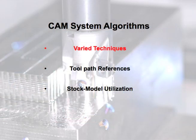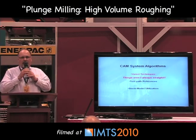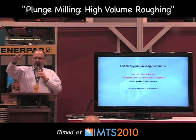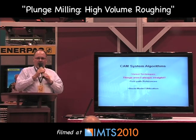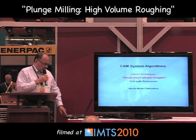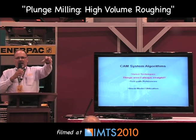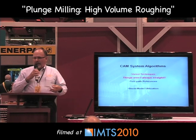We'll get into some tool path references. Things are not always straight — you'll sometimes have draft walls. In that case, you're not going to be plunging and riding out; you're going to be just stepping down, creating a stair step. Think of the pyramids — from a distance they look solid, but they're actually lots of little graduated steps. For 3D plunge milling, that is something you'll find very effective. You can go in from a big block of steel, stair-step it out to a basic form, and then come in with a secondary operation to remove the edges of the steps.